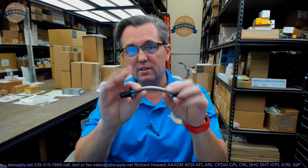Why not just use a hinge? Well, maybe you have an application where there is no hinge that you can use as an electric transfer hinge. What I mean by that would be maybe an unusual hinge by a residential door manufacturer. Some of these residential door manufacturers have highly unusual hinges that you can't mix and match with other hinges. There's no electric transfer option in some items, and I'll show you an example of that. You might just get away with something like this.